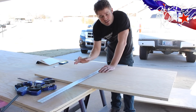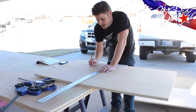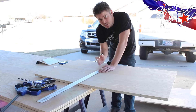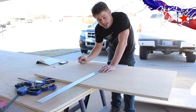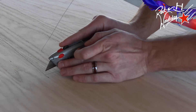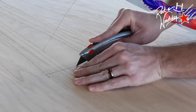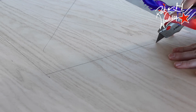Now this is the back — it's 31 inches wide by 48 inches tall. We're doing some pre-marking right now: 30 inches from the bottom and 16 inches from the side. This section right here is going to get cut out. This is going to be on the plywood sheet good side, and this right here is for my scrap bin side. Just as before, we're going to scribe a line with a utility knife blade to make sure we don't get any tear-out when we run the circular saw over.